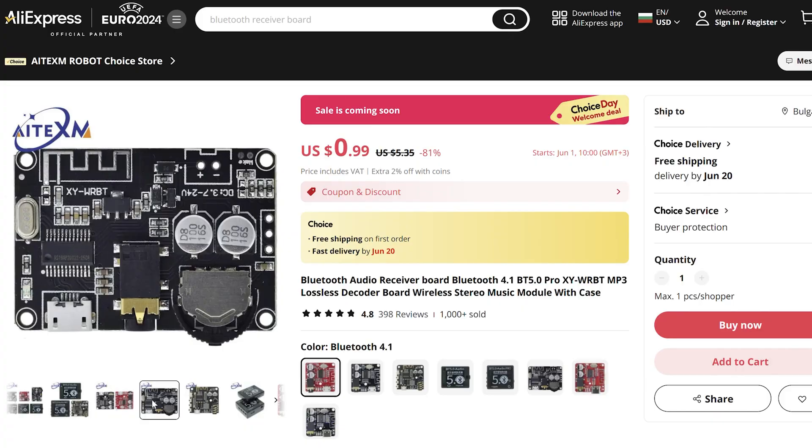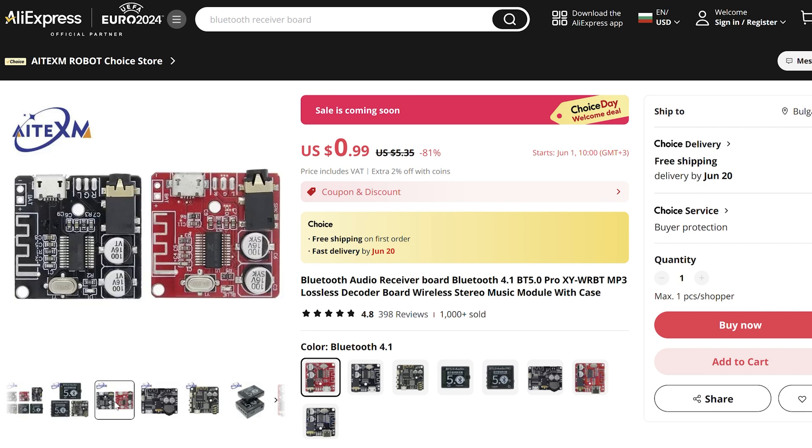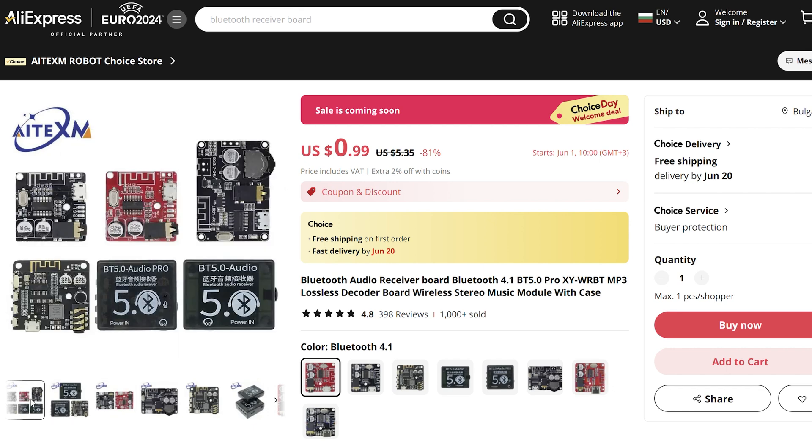In conclusion, I think these Bluetooth audio receivers are worth getting. The good ones have decent range and audio quality and work really well considering what they cost. But buying one can be a bit of a gamble, so make sure you read the comments first to know if the module has the annoying voice notifications and whether it has decent range. I have links in the video description. If you are making a custom DIY wireless speaker, you can totally use one of these — just make sure you provide stable voltage, use wires as short as possible, and consider adding an isolating transformer to avoid noise issues. Thanks for watching and subscribe to never miss any of my future videos.